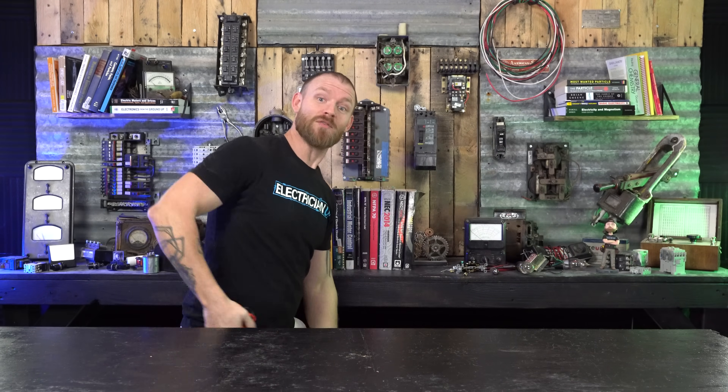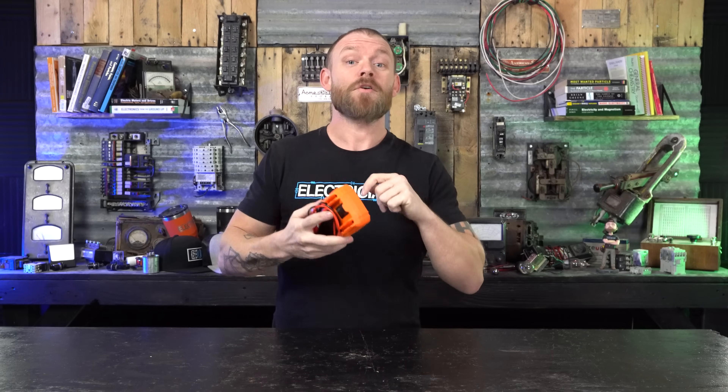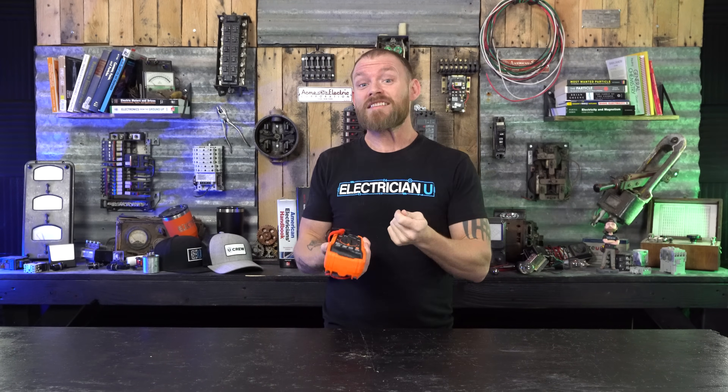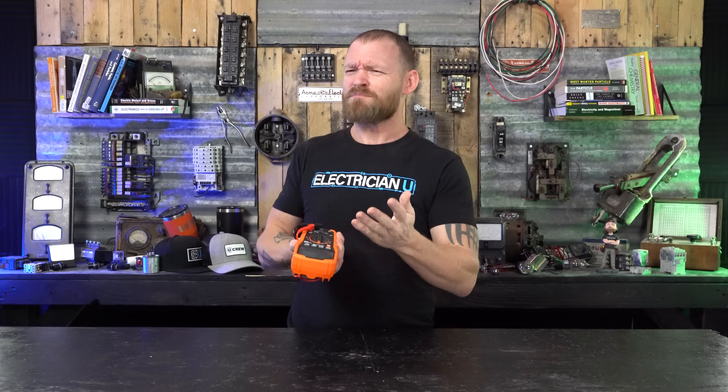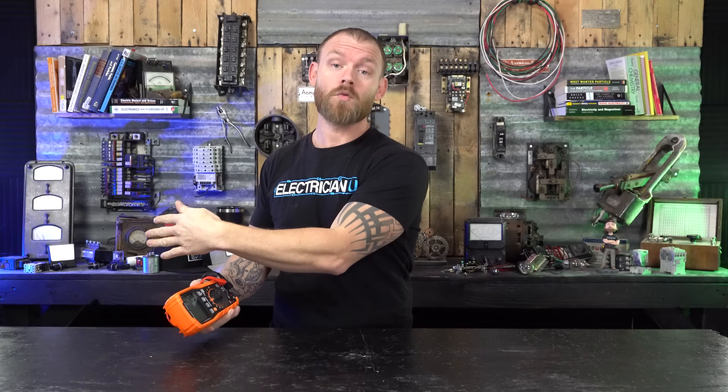Because if you think it's 120 and you go to plug in your vacuum cleaner, you're gonna fry that thing. So you need to know voltage between two things — what this is relative to this. That's why it's really important to be able to test for voltage. Now, there are also things that should never have voltage between them, and that's really important too. So we use a multimeter that tests voltage between two things that should not have voltage. If you ever get a service call because somebody is getting shocked every time they touch a metal doorframe, you have to start testing to know — okay, that's a metal thing that probably has something to do with grounding, maybe a neutral. So you're always going to be testing multiple different places to see where is the pressure getting to this, what is the potential, what is at a different potential that's allowing current to flow through it.